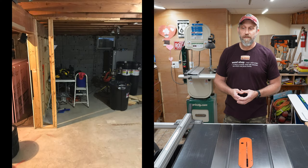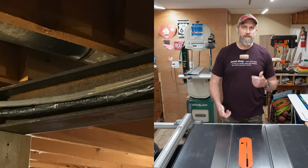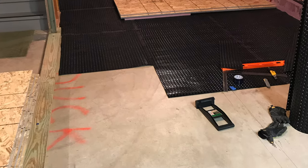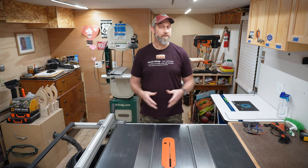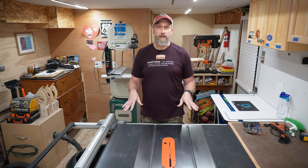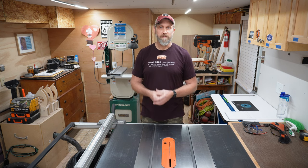When I bought this house, the basement was unfinished — the floors were bare concrete and some of the walls were bare concrete. There were some rooms built down here but it wasn't really finished out, so I knocked down walls and put up new walls. I put in a subfloor because concrete is porous and allows vapor to penetrate through it at all times. Even though we're at a relatively high elevation so flooding shouldn't be a problem, the vapor issue is what I was trying to mitigate. What the subfloor does is allow air to flow underneath the OSB so that vapor can dissipate up and through the walls. There is no musty smell in this basement — it's super dry and climate controlled.